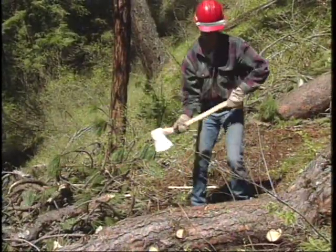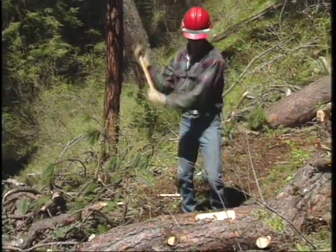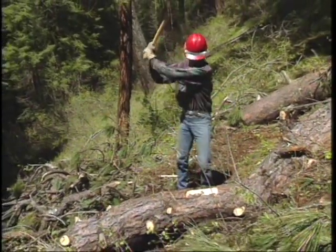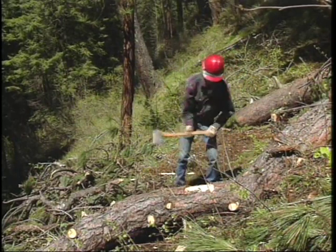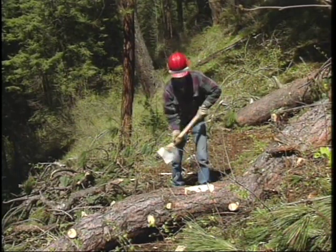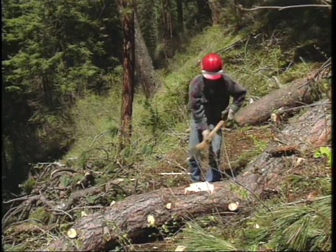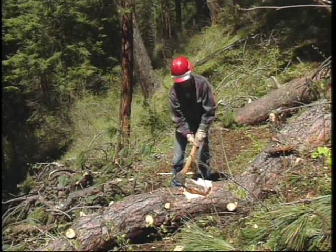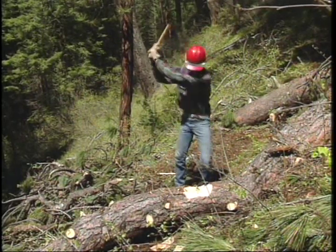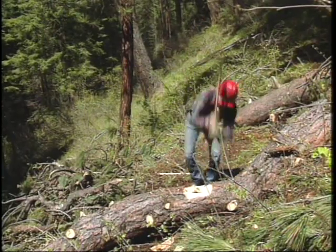Try to be as efficient as possible — strike that wood as many times as it takes to completely sever your cutting surface, then move to the other side, rather than alternating chops repeatedly. Often times in a large log you're not going to be able to remove your first chips by making a wide cut. So you'll start with a narrower V in your cut and cut down until your V comes to closure or to a point.